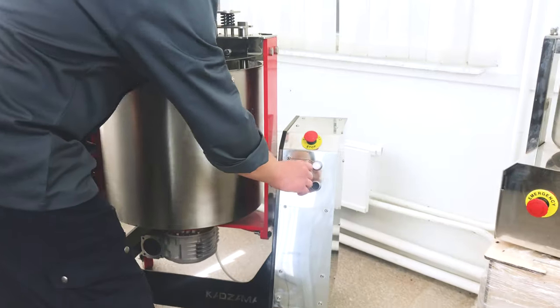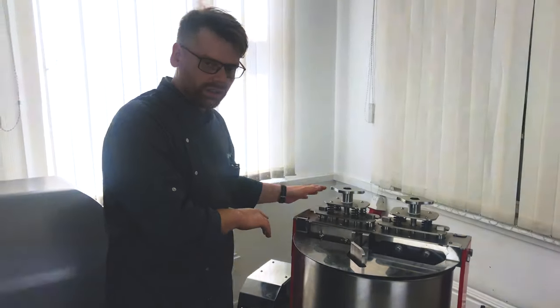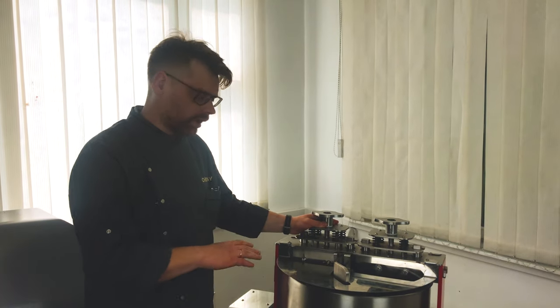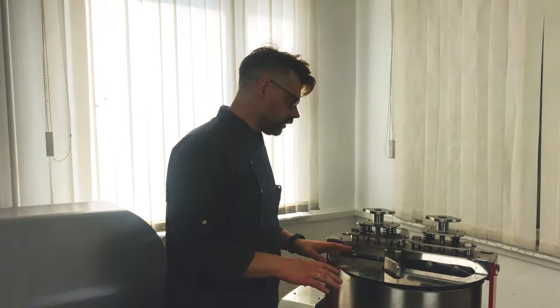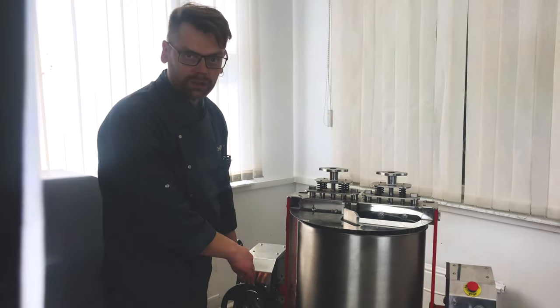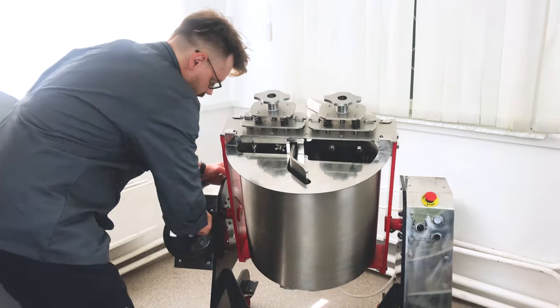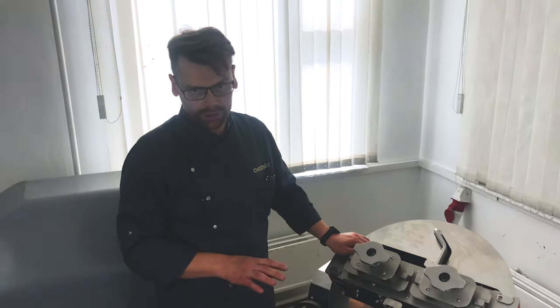How to switch it on? You see? Another very important thing about our Melangeur. So, if we have this situation when electricity switched off at the night time, but for example you came and you see that you can save the chocomass inside, it is liquid, but there is no electricity, you can use our manual reducer to unload the chocolate out from the Melangeur. See, here is, we do not use electrical reducer, electrical system for unloading. Only manual reducer lets you unload chocomass even without electricity.